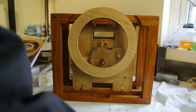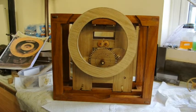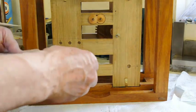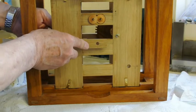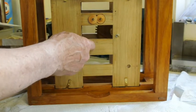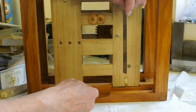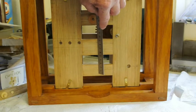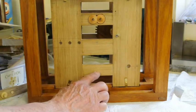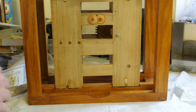A good example would be if this here isn't in the middle of there. Turning to the clock frame — you'll recall that I sighted through this hole here into the cross behind the back, so that is the centre of where the hands go. This is going to need to be 79mm on a straight line here, and that's what that cutout is for — just to make sure it doesn't foul the case. So 79 is roughly there, about on that mark, and it's dead centre of this, so it will be easy enough to mark out, drill it, and I'll put a pivot in straight away.